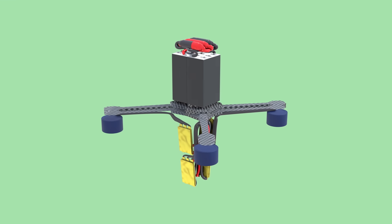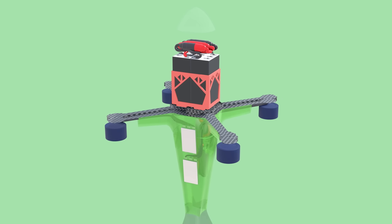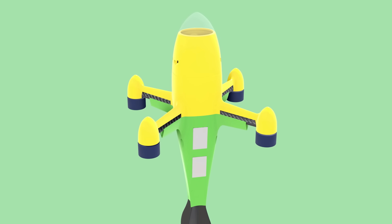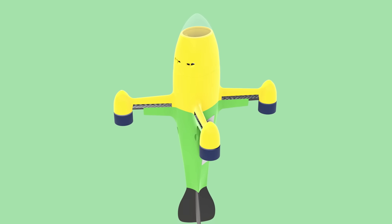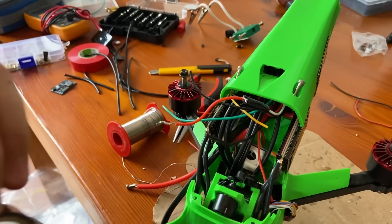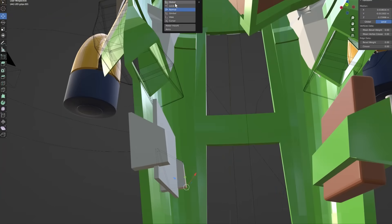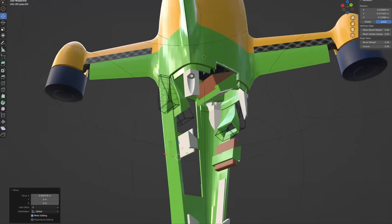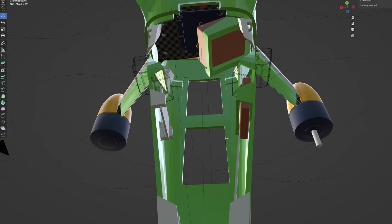Version 1 was wasting engine power just trying to stabilise and go straight instead of going to forward thrust. So a longer tail to accommodate the motor controllers seemed like an obvious solution, and placed on the outside they could get excellent cooling. Smart move, right? No — the wiring proved to be a nightmare and not fun to fit. We were growing concerned that the large increase in body surface area would come at a high cost of drag and cancel out the extra power.